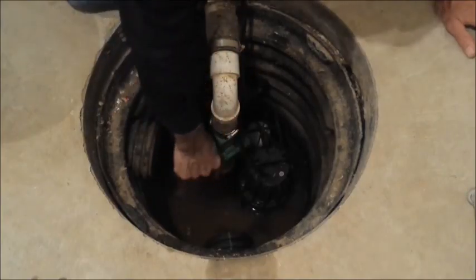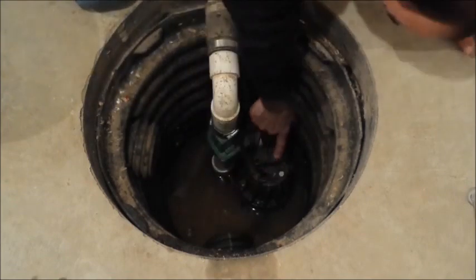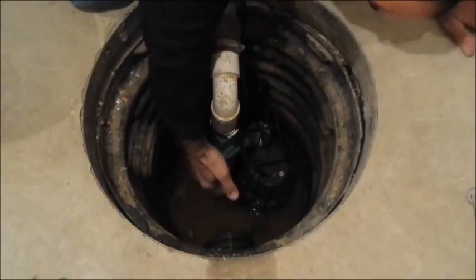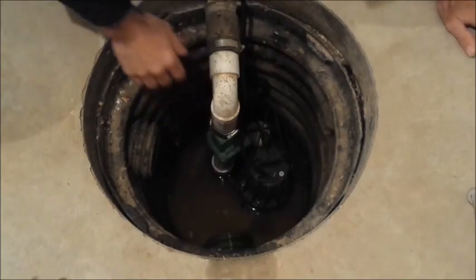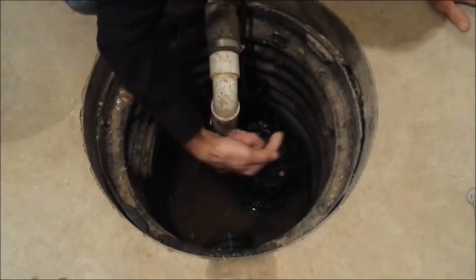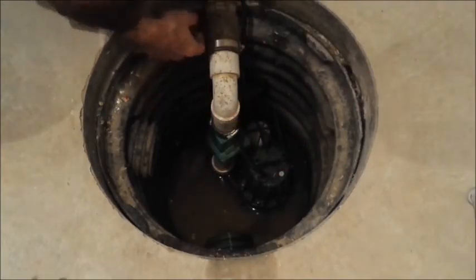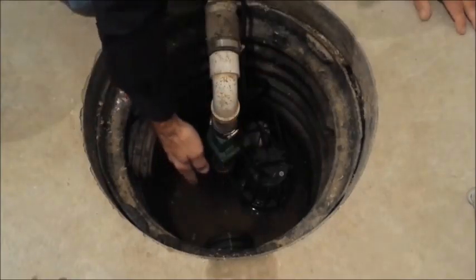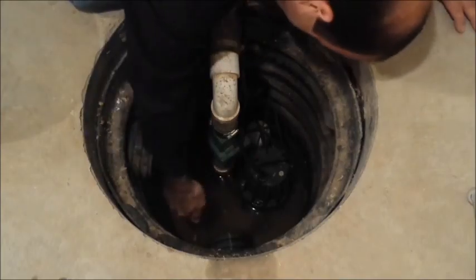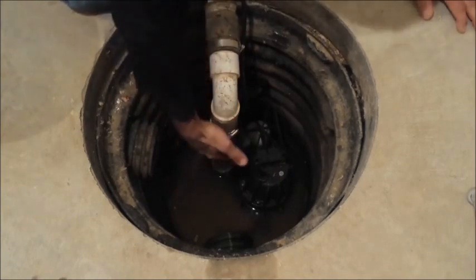This is a low point in your basement where water is going to collect. The water collects in the bottom here, and this is our sump pump sitting down in here. Out of the sump pump is a pipe, and then we have this — this is called a check valve. A check valve is for one-way flow of water, so when the water flows up and the pump kicks off, all the water that's developed upstream in the head of the pipe doesn't run all the way back down and fill the sump basin back up. This holds the water at that point. When more water fills up from the bottom, the pump will kick on and pump more water out through the check valve.